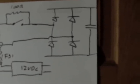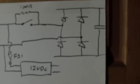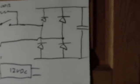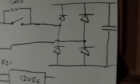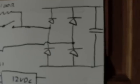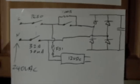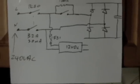So the final part that we have here is a single phase bridge rectifier and a filter capacitor, and the purpose of that is to convert our 240 volts AC into a DC bus across here that's approximately 300 to 320 volts DC. That's with a 240 volts AC input. A question I'm frequently asked about this charger is, could it actually operate on 120 volts AC?